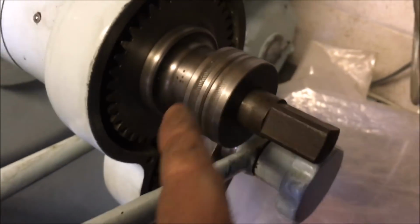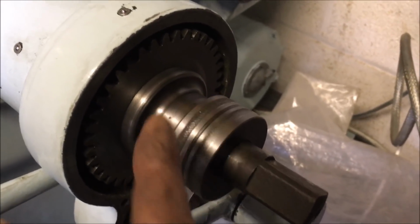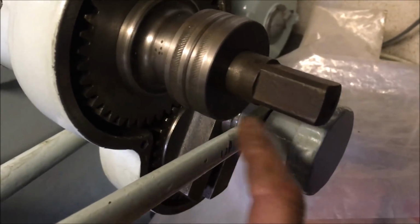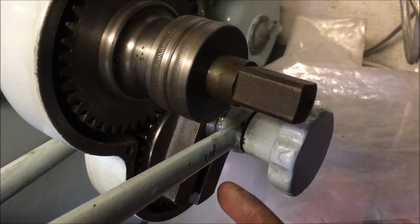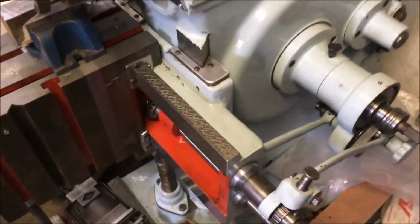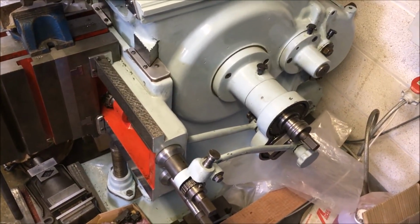and that's all set by these two gears here. So that gear's fixed to the main bull gear, which is driving the ram, and then that one, there's no gear reduction or anything, it's a straight transfer. But depending on where you mesh this gear in relation to that orientation of the crank, if you like, determines at which point it starts to feed. So if you watch it now, should get it from there.